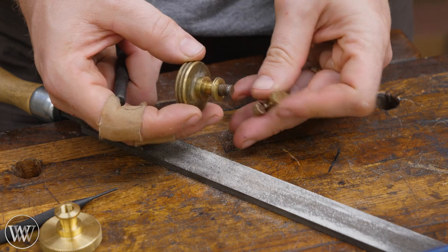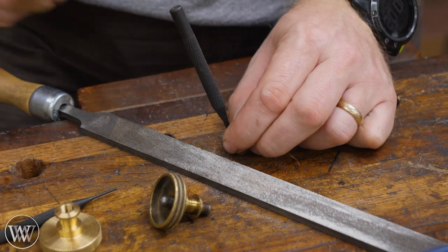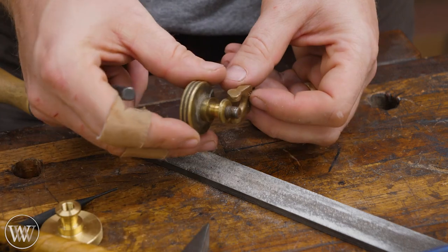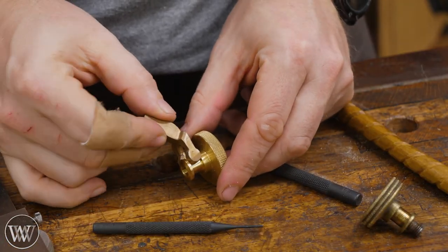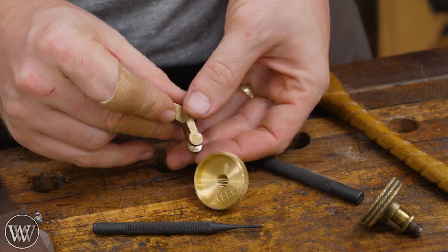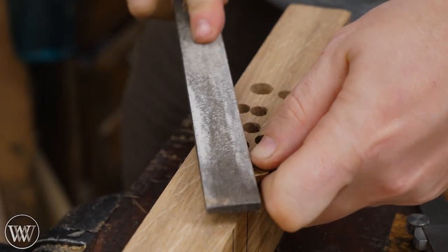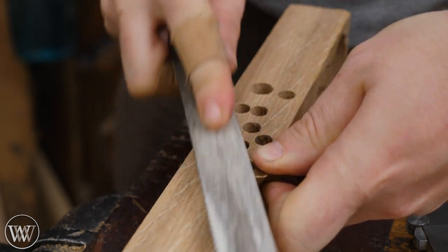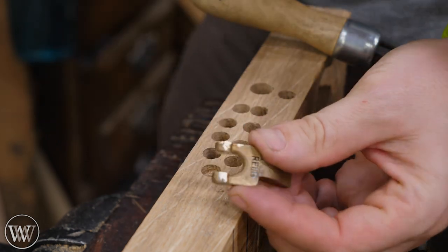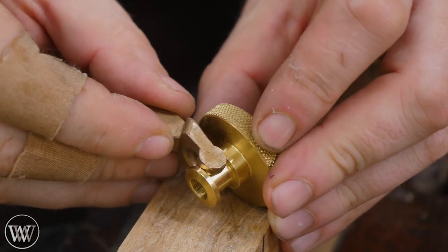We need to work on getting the balls to fit in between there. They're always a little bit large, especially with antique ones where the gap tends to spread over the years. If the nut has expanded over time you may find there's a good bit of slop. To make the balls a little bigger you can take a punch and slowly work them down to widen each head. But most of the time they're going to be too big, so we want to file them to fit. Set the yoke so the arm is at 90 degrees to the shaft of the nut, and take off material to make them fit down in there with a nice slide.